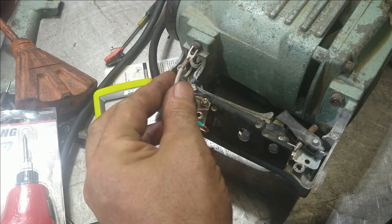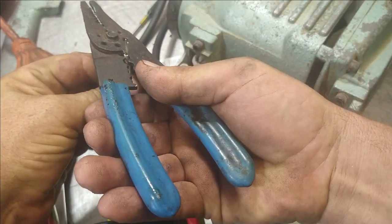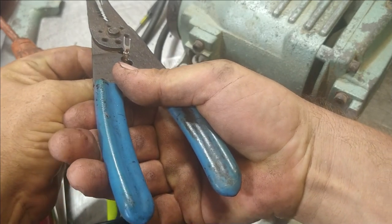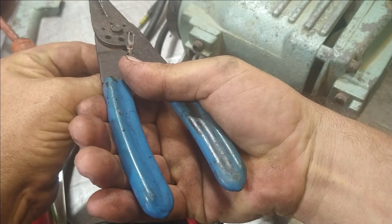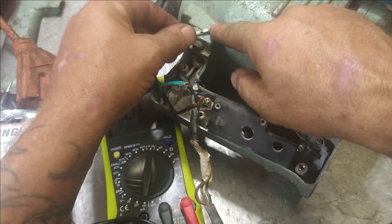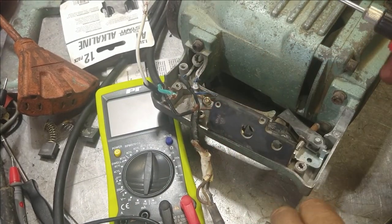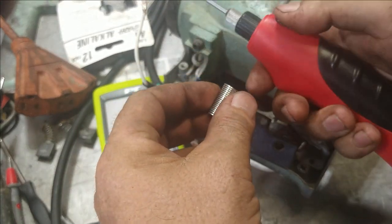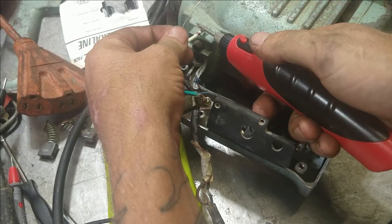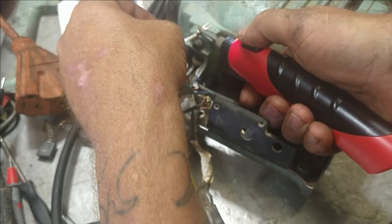Then I crimp it in place. Then I like to get the solder out and we're gonna solder this into place. In your solder gun, a little bit of solder, push this down, it heats it up. I'll put these in the description below. I'm gonna get this down on here, push this down, get her nice and hot.